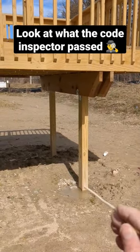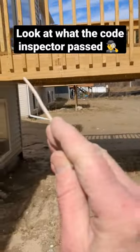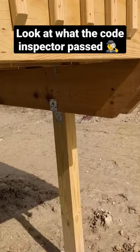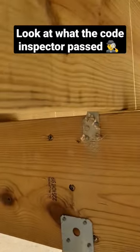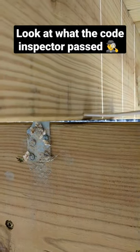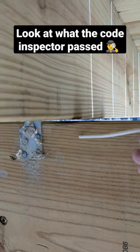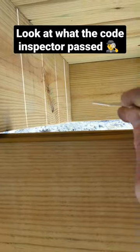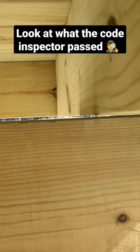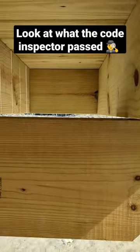This is your post and beam, and these floor joists are designed to rest on top of that beam — and here they're not seated properly. Looking up close, you'll see right here, this is not even seated properly where the floor joist is supposed to rest on the beam. These are relying on that rim joist at the very end. This one too — you can see the daylight right through it. This is a brand new deck, improperly installed.